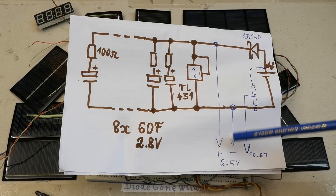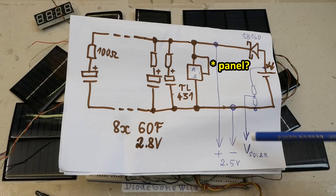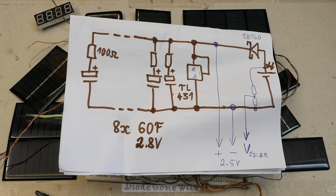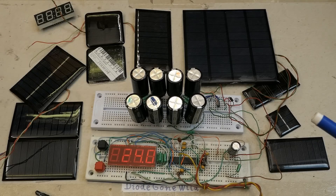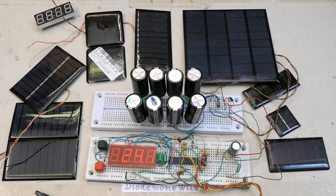The charging voltage is limited using TL431 in the two-terminal configuration. The voltage goes into the thermometer circuitry, and there is also some voltage sensing on the solar cell which can dim the display at night. Because this produces just 2.5 volts, the display has to be red, yellow, yellow-green, or orange — basically the ones with a lower voltage drop. These drop about 1.6 volts at very low currents and about 1.9 volts at high currents.